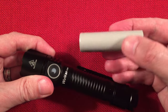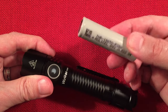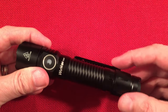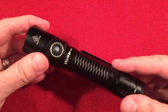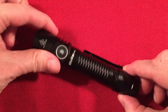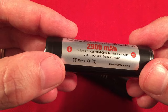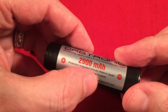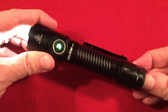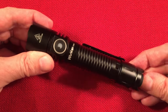The battery cross-compatibility is great — this flat-top Moli cell has no problem handling a 2-amp charge and can output up to 30-35 amps. When I have a problem flashlight that can't handle a battery, I put this in and everything works perfectly. The flashlight accepts all 18650 types as long as they support up to 6 amps. Also, the battery status LED is a nice feature — just a momentary tap lets you glance and see what battery life you have left.